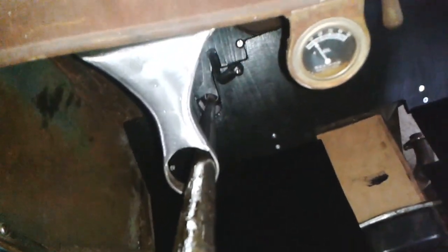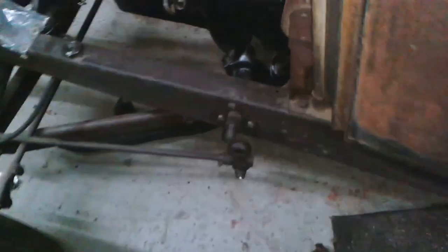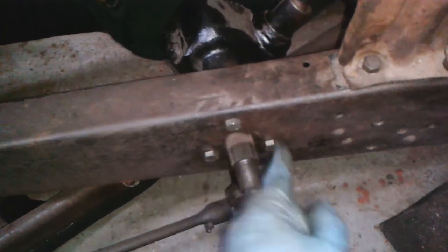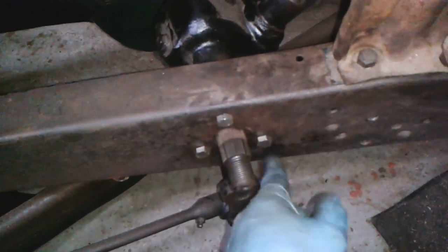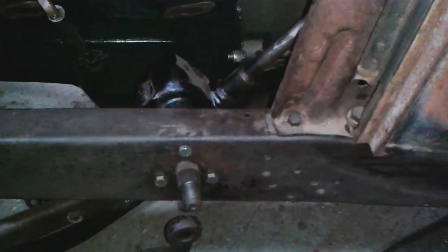Okay, first iteration - that's with four washers on each bolt. You can see it's pressed hard over against the right-hand side of the bracket, and the bracket's not even bolted in tight, so it would pull it even further. I'll take maybe two washers out of both of these - that will bring it over. I'll try that first.